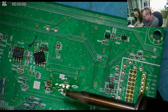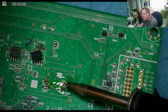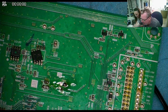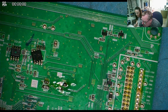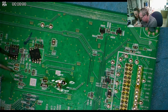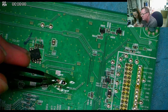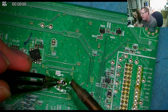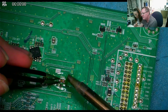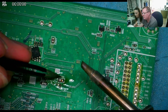I put it on the right-hand side as I'm right-handed. What I'm going to do now is use the bottom edge of the solder tip — not the flat, just that edge. A bit of wire — we've got a little bit of solder, a little bit more. Now let's find something to put back on. These are called capacitors, by the way. So we get the component, and I'm going to slide it towards a little blob of solder and slide it into it. What I did there is I lifted it up before the solder had solidified — it was still partially molten. Give it a few seconds. That's now stuck down.